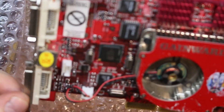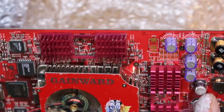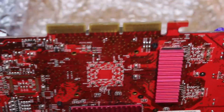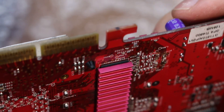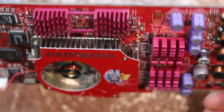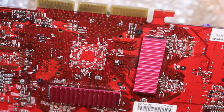One of the bigger ticket items here — this is a Ti 4600 that is in really poor optical condition. No fan, everything was kind of loose. We've got bad solder jobs here, and these bad solder jobs indicate that somewhere around those memory areas there probably was an impact that ripped off some parts and likely damaged some of the balls on the memory as well. Getting off the heatsink is going to be real challenging — I'm probably going to have to soak the whole card in paint thinner for like 24 hours. But overall it doesn't look completely destroyed — looks quite possibly fixable.